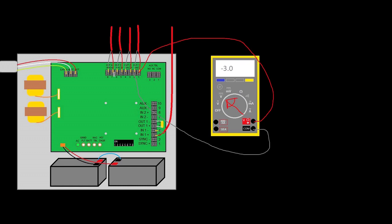The next thing I would do is confirm that by disconnecting the wires, changing my meter from DC voltage to resistance, and metering the end of line. But something weird is going to happen when you do that. Let's assume you've got something like 10 horn strobes on NAC1. You take the wires off, disconnect them, put your meter leads right on the copper of the wire, and set your meter for resistance. Let's say when you do that, you get an OL.